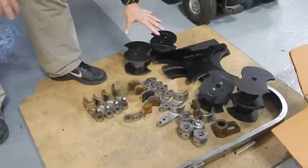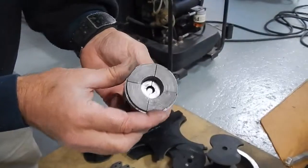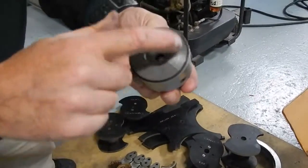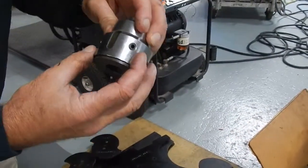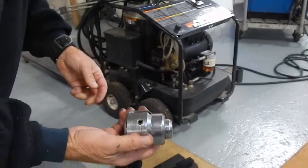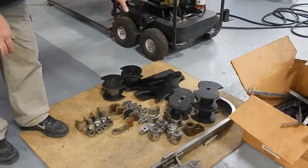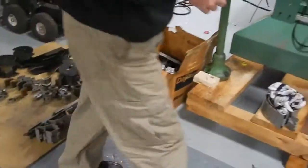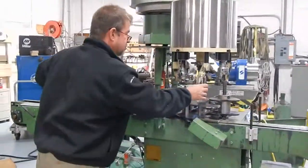While I'm over here, there are some other change parts: another set of grippers and another chute. These apparently seem to be for about a 28 millimeter cap. You'll notice the knurling — the little lines inside the edge — this may have been a metal cap. These are the four pieces you would change: you keep the housing and change this diameter. The whole mechanical mechanism, as well as the spring-loaded clutch which allows you to establish your torque, would all work well just by changing those. There are also star wheels and center guides here for an eight-ounce bottle, which can be modified for a larger size.